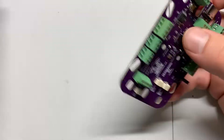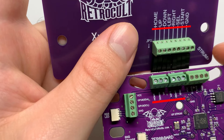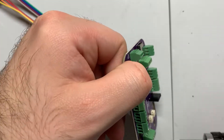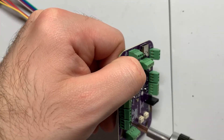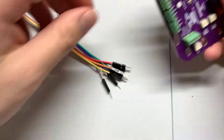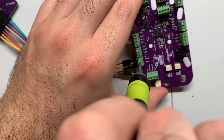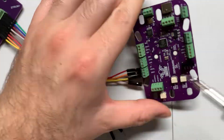Next, take a look at your strum board. You'll see the inputs of the breakout board match the inputs at the top of the strum board. The up and down inputs are swapped on my initial batch of the breakout boards, but it'll be fixed in my next batch. You can connect down to up or up to down interchangeably — it'll work just fine. Just like the breakout board, rotate the screws counterclockwise to loosen them, then clockwise to clamp them down onto the wires.